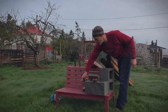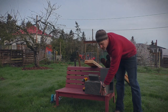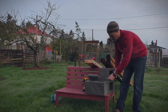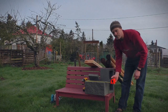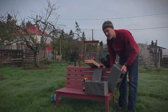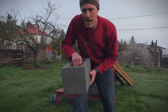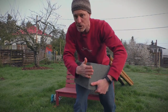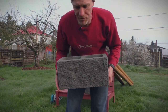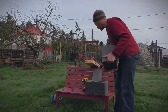The third option is these landscape blocks. The dimensions are 8 inches tall, 8 inches deep, and 16 inches wide — so 8x8x16. The beautiful thing is they're not solid; solid would weigh about 80 pounds, but these are about 40. The backside and the ends are smooth so you can put them end to end, but the front face is gorgeous — it's called a split-faced block.